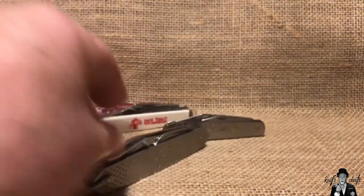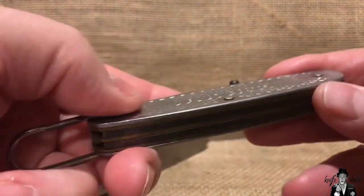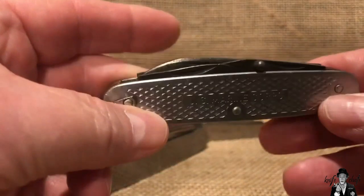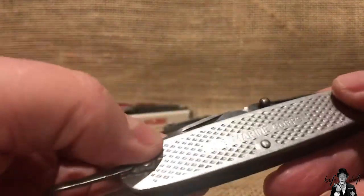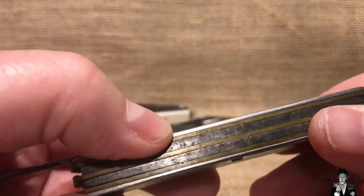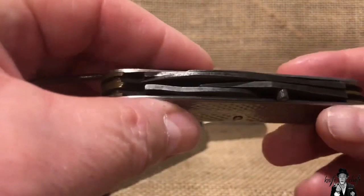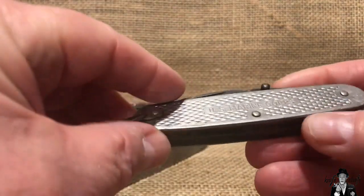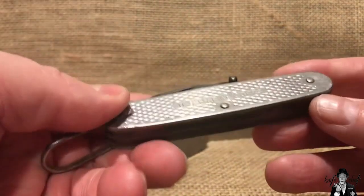The original ones had a stainless steel outer layer, then you had a brass liner, brass spacer, carbon steel backsprings, and carbon steel blades. So this knife has been around for a long time. This type of stainless steel cover, or scale — technically it is a scale because it's the outermost layer facing the blade. Usually you would put a cover over the top and have bolsters, but because there is no cover going over this layer, technically this also is the cover of the knife.